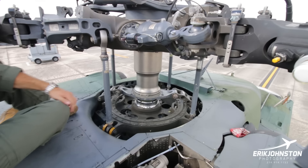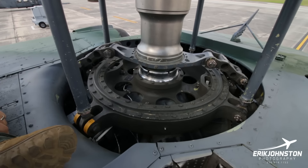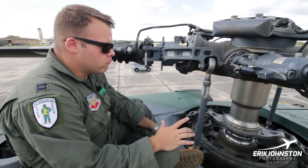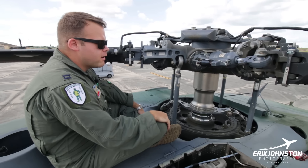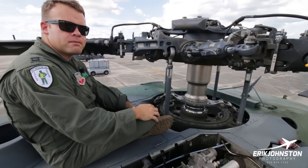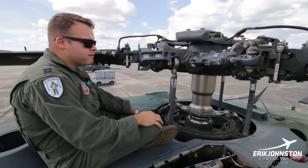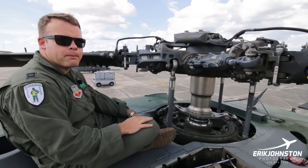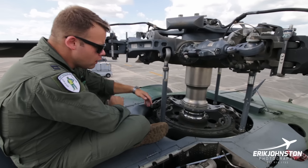Down here we have our main module — also known as the main transmission — a pretty neat piece of design by Sikorsky. It's a three-stage planetary system. The engines spin at just over 20,000 RPM, but the main rotor only spins at 258 RPM, so you've got to really reduce those gears. Each engine goes into its own individual input module, then into the main transmission where it's geared down to 258 RPM for the main rotor, and it also has the output for the tail rotor. The transmission was completely sealed — unlike, say, the H-3 transmission which had oil lines all over the place. This is essentially one solid piece of magnesium, so everything is internal, which helps ballistically and from a maintenance standpoint.